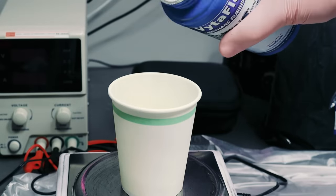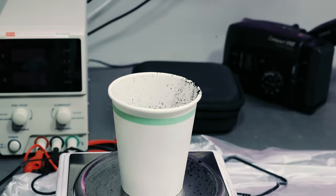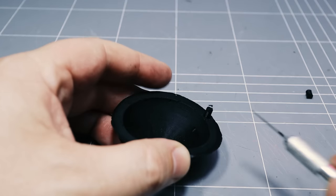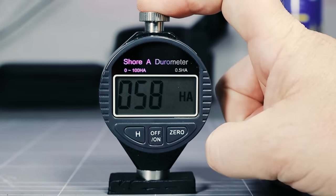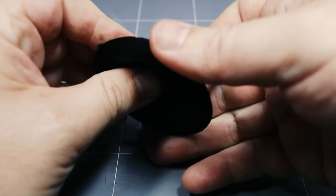So I tried again and mixed another batch of polyurethane rubber, but this time with less carbon black — down to 5% weight by weight. The industrial Vegemite was much smoother, which gave me hope that it would perform better. After removing it from the mould, I trimmed it to clean it up and then tested the hardness. It looked about right, but did it pop? It sure did, and it was a lot better than the previous version.